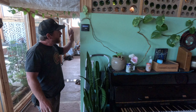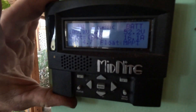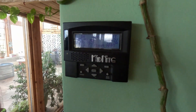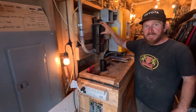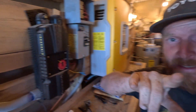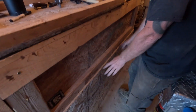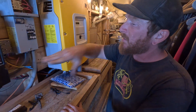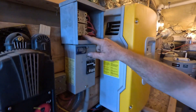Right now I'm running a Midnight Classic 150. This is my charge controller panel and we're at float right now — standard charge controller operation, 48-volt system. Inside is where my actual Midnight Classic 150 is, thanks to Chuck Cassidy. So what's happening here with the dump load is: once the batteries hit full capacity, this charge controller clicks over a 12-volt signal to this relay right here.